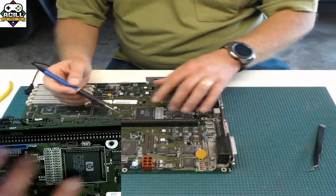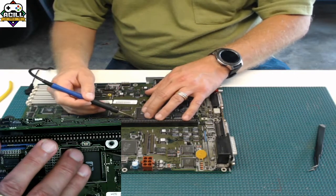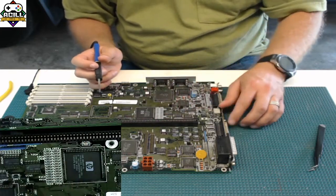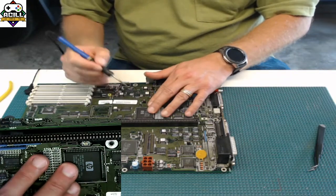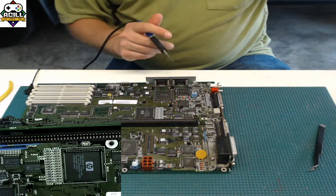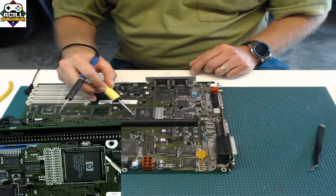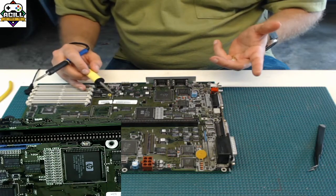And you do the exact same technique. You'll flux it. You will put a single solder point on, lock the chip down, go directly to the opposite corner, and solder one down so that it is locked in place. Inspect all the way around. Put some flux again on all four sides and go to town. You can use a knife edge and load up the edge of the knife on the side here. Flip it over like so and drag solder it across and it'll work just fine.